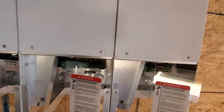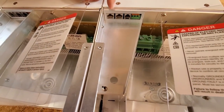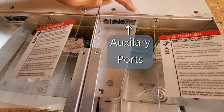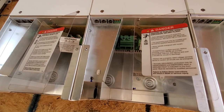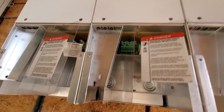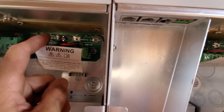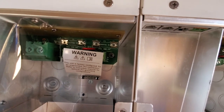Those ports are up here. Each one of these had a battery temperature sensor. The battery temperature sensor is this one. These are the two cables for the ethernet to talk to each other. These are auxiliary 12-volt ports that are made to do several things. I don't know if I'll use those or not, but it's an option when you set your system up — they will power something. One of them is an auxiliary fan. Your fuse is in here. The kit comes with a fuse. Your fuse will go on the negative side only — they said the positive side you really don't use. That's more for a commercial application, as I was told watching one of the Schneider online videos.